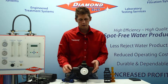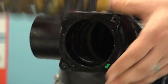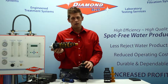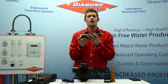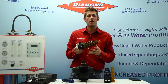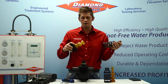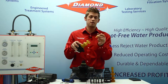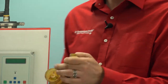With all of the bolts removed, what you have is your end cap assembly — pull straight out. Two things are going to happen: in most cases, your seals and stack assembly will stay in the valve, and your piston will come out separately. As you can see, this is a used valve — it's dirty, it's crusty, the piston's in rough shape. I'm going to separate the piston from the seal stack. In this case, the piston was actually broken. This is your brine piston that controls the water that comes and goes to your brine tank, and it's broken.